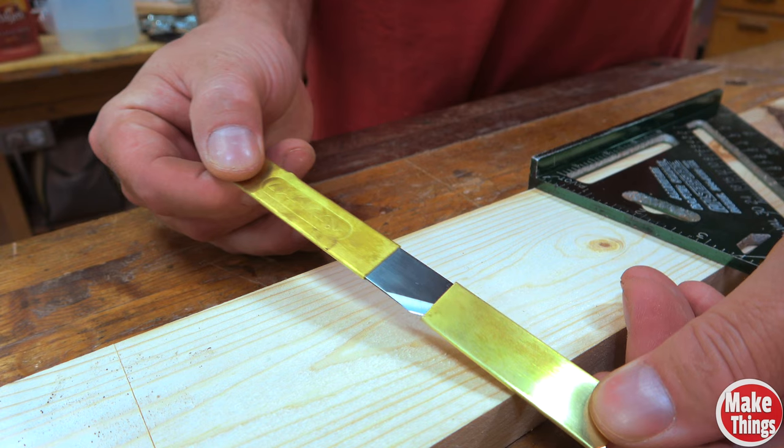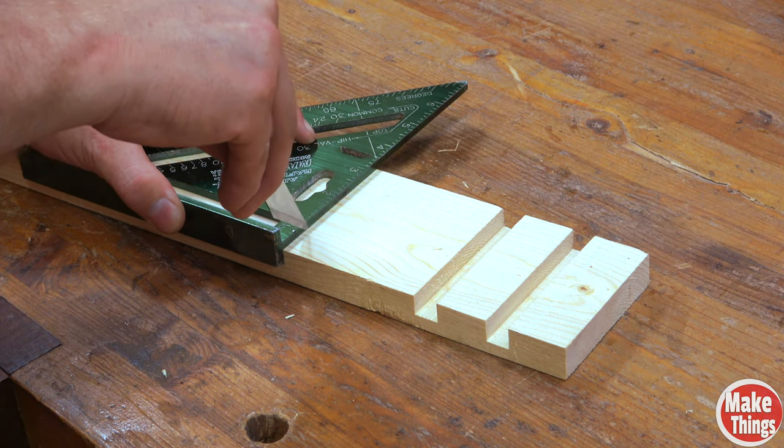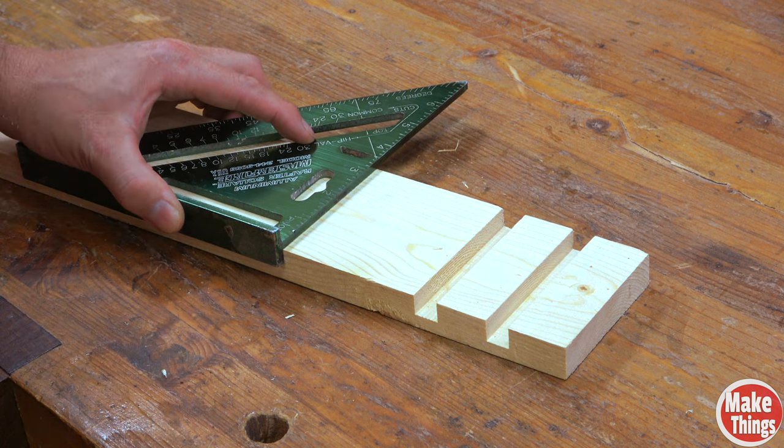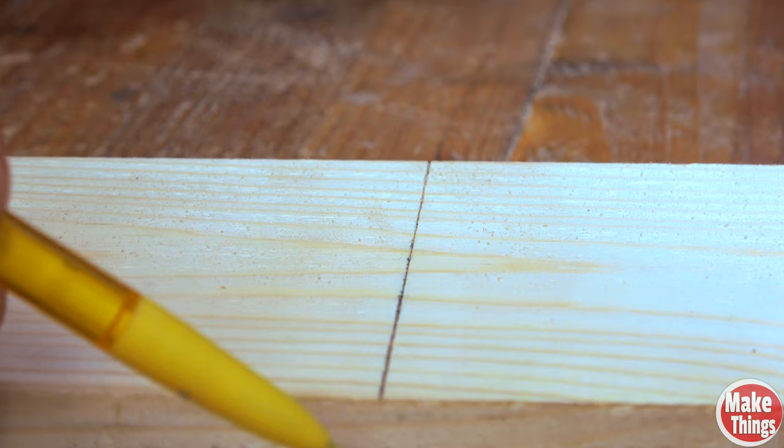But if you want to get really cutting-edge lines and perfect joints, grab yourself a blade and score. I bought one of these kiridashi knives and it gets me right next to the wood. If you're worried about seeing what you've scored, grab a mechanical pencil, angle it so that you're getting the edge of the point, and lightly scribe over the top of your recent cut. You'll get the thinnest lines you could ask for.